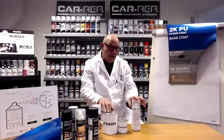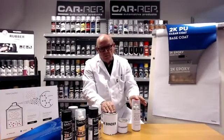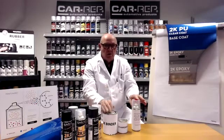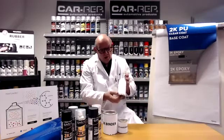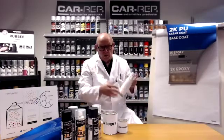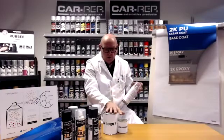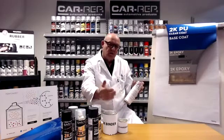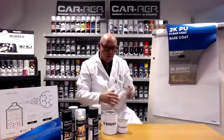That means these two products have a pot life. As soon as they are mixed together, the reaction starts, and from liquid epoxy paint, the pot life is, depending on what product you have, between 45 minutes and an hour and a half. They claim for this aerosol product that it is around one or two days. But at the beginning of the can you will use a different product than if you come at the end of the pot life, because then the polymerization for a big part has already taken place.